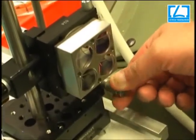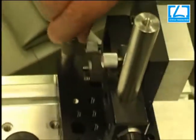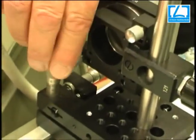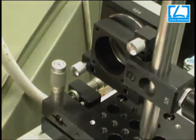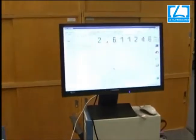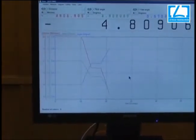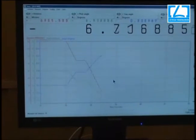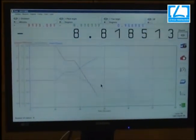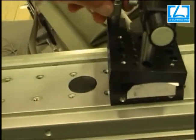Now we make a test with special screws and a special holder to generate a pitch angle of about 10, 12, or 13 degrees, and also in yaw. I am taking the screw for bending the pitch angle. You can see on the display it is going in the direction of minus 10 degrees — 8, 9, and 10 degrees, normally a little bit more.